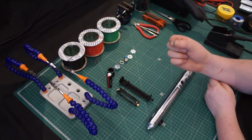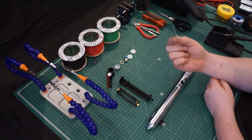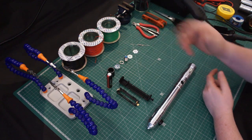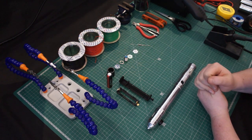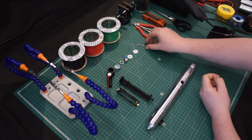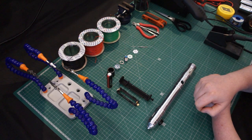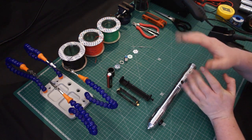With each kit, whichever one you buy, you'll get your appropriate resistor for your LED. In this case we'll be using a 1 ohm, 1 watt resistor. We've got a royal blue LED we're using today. Because the Cree forward voltages are fairly high and close to the voltages of an 18650, it's actually okay to just use a resistor for good practice to limit the voltage just a little bit. There is an LED resistor calculator which I'll go through in a separate video, but I'll include the right resistor you need for the kits anyway, so you won't need to worry about that.